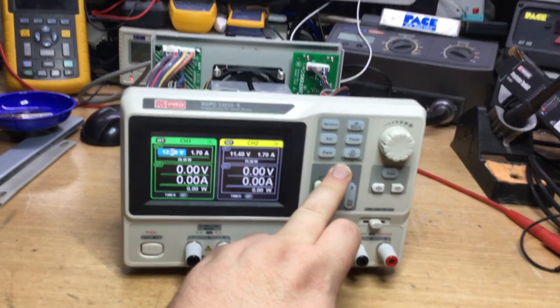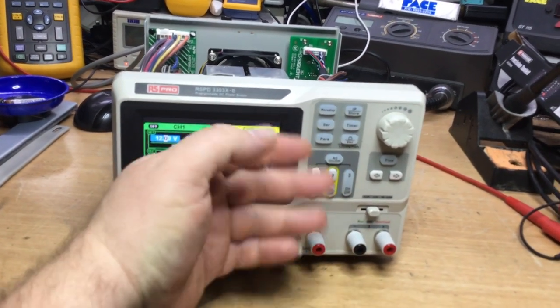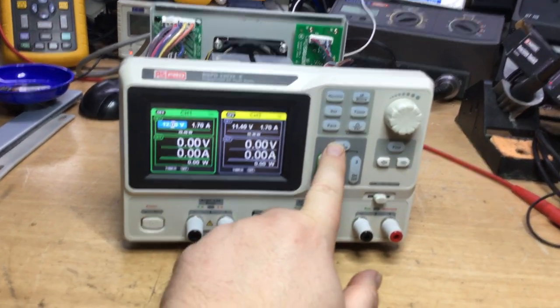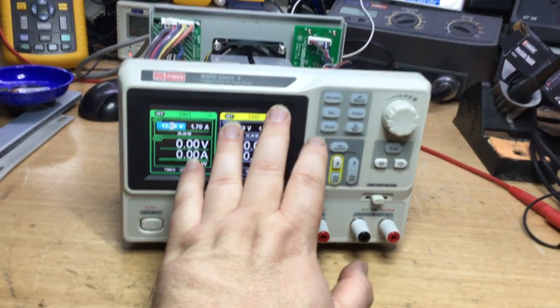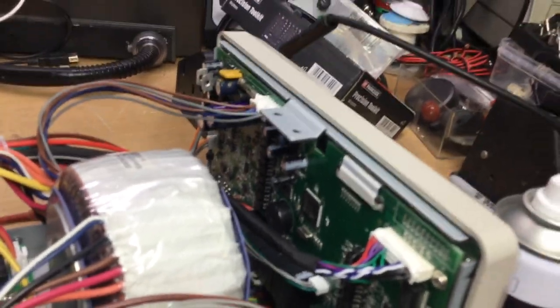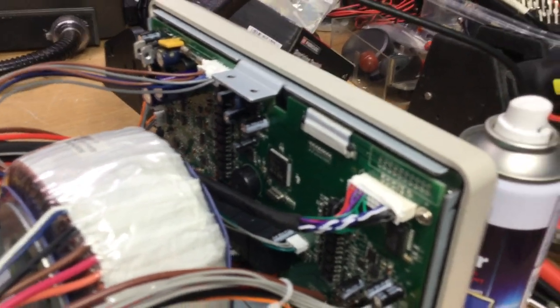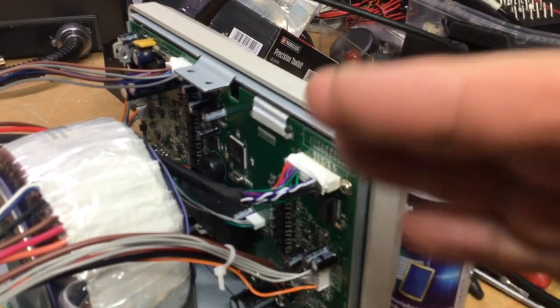And it seems that when you hit this high current consumption button, by obviously switching the output on, it loads the circuit more as well. When you select that, I can hear what appears to be the oscillator down here on the board that we were looking at earlier. I can hear something screeching or screaming oscillator-wise, like a coil resonating at a frequency of the switch mode power supply type sound. It's like a high-pitched whine, a whistle.